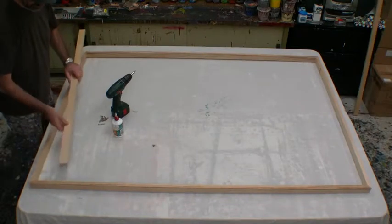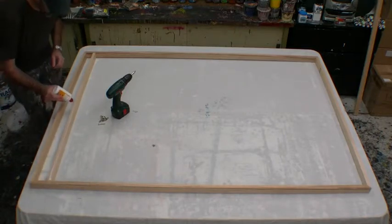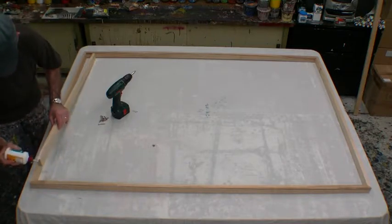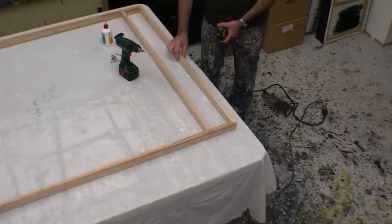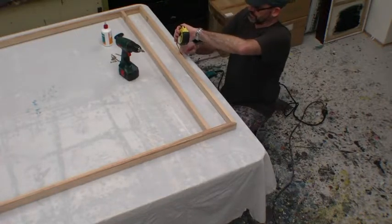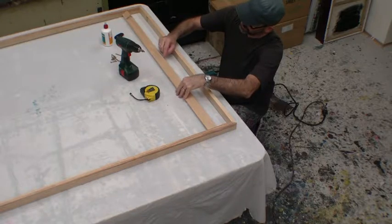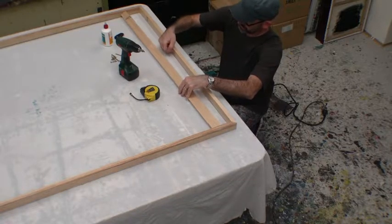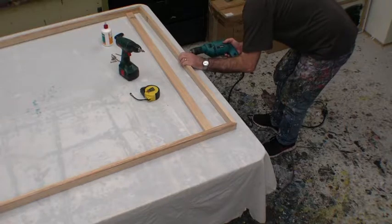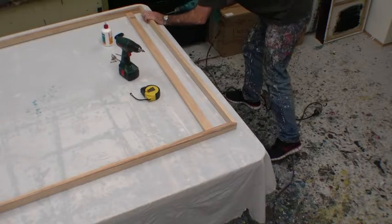Once we have that cut, they fit inside the frame. We put this on the side of the frame where we're going to put our hanging strings — this is the side we need to be the strongest. Once they're cut and ready to position, we measure down the side to do some pilot holes. We want these to finish in the center of the timber you're going to attach, and to sit down about seven millimeters from the top edge. That gives us the position for our holes, and I'll show you that in closer detail.